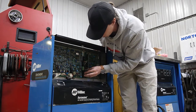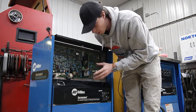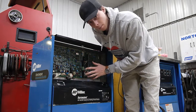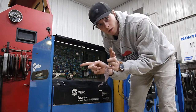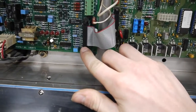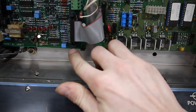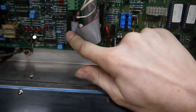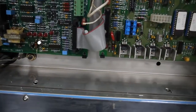These ribbon cable plugs are pretty cool. When getting the pins lined up — because most of them have a couple dozen very small pins — make sure you line them up perfectly and aren't forcing anything. Then push it into place; there are two tabs on each end of the plug that will snap into place. If you need to remove this cable, just pull down on each of those little tabs and it wiggles the plug out. Push in very lightly, you can see those tabs fold in, then press those tabs together to confirm it's fully on.